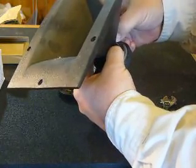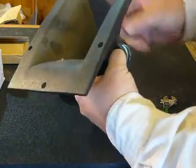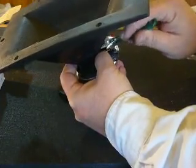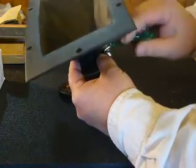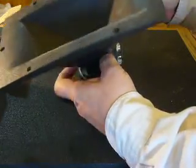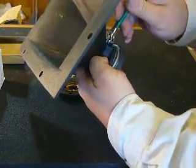I paid $17 a piece for this kit. If you have a horn or tweeter of any kind in a set of speakers that has blown and they're rebuildable like this, I suggest you order a set of replacement diaphragms for both — because the new one could be somewhat louder than the old one, and you want them to be equal. I usually just finger-tighten these and then cinch them down just a little bit. Do it in a tire pattern — go around evenly. Don't cinch one down all the way and then do the others; disperse the energy.